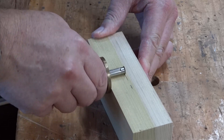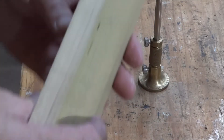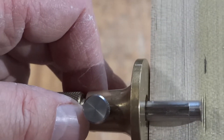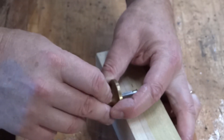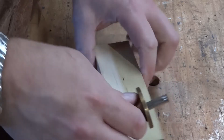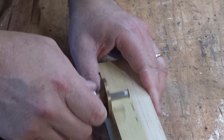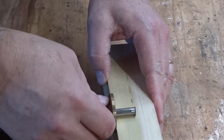I'm going to make a mark on the wood, then flip it around and make another mark. You can see they are separated. When I'm coming from this side you can see that my marking gauge is making this line, so it needs to go closer to the center by half the width between those two lines. This is where the fine adjust comes in — I can eyeball it, make a little adjustment, mark it again. And if I land in the line — not yet. There you go. Now I'm dead in the center. I get that groove on both sides.